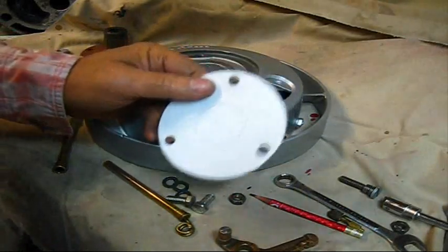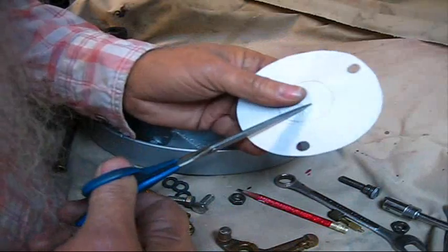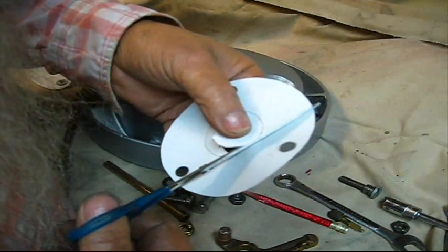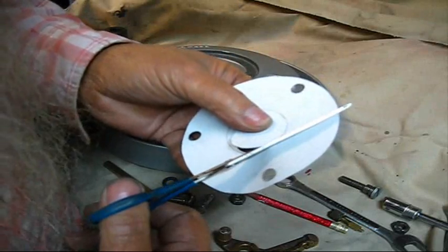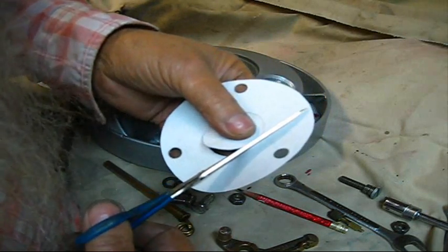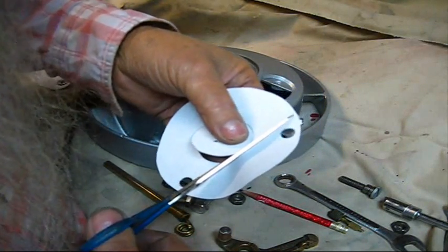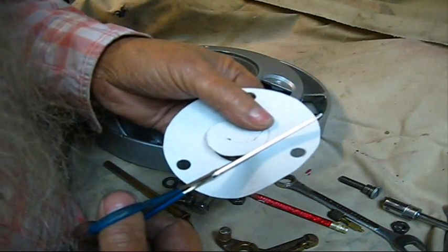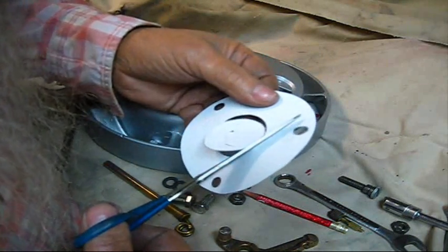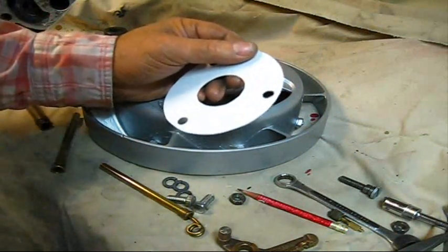We're going to go ahead and time it — we're done. But you may be thinking, what's he making such a big deal out of this other stuff for? The reason is that if you're having a problem with your Maytag ignition system, it's probably not your timing. 99 times out of 100, it will be just plain dirt — dirty contacts that don't make contact, corrosion and such as that. Nine times out of ten, something just simple. But it's that other time when you've got a bad coil.